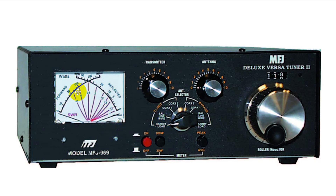Although this can only handle about 150 to 200 watts, the meter itself will go up to 300, and you select that by pushing that button. Or if you're doing QRP, it's hard to get much deflection, so you can switch the sensitivity. You can also choose whether you want forward power to read peak or average.